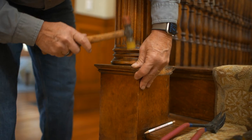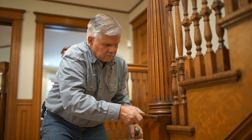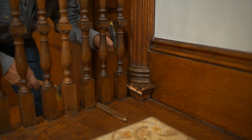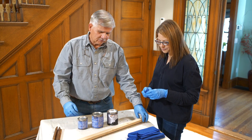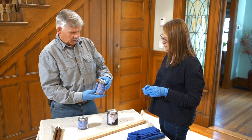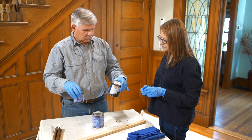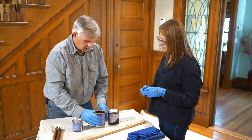Let's get started. All right. Now they should come off pretty easy — it should just be a finished nail on there. All right, Maddie. So you're going to help with the staining, right? Yep. Perfect. So I brought a piece of scrap white oak, because I remember the staircase was white oak and all the molding that we made in the house. I'm also doing this from memory, not only on the profile for the molding but for the stain. I'm thinking a nutmeg stain will work, but if it's too light or too dark, I brought some tinting — some more stain that we could either add lightness or darkness to. So let's start with the one I'm hoping works. It's a gel stain.